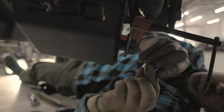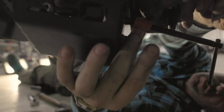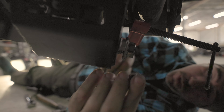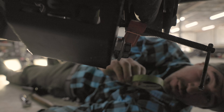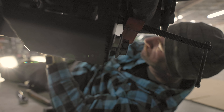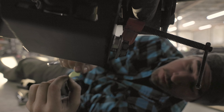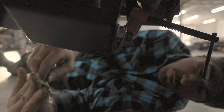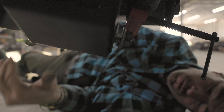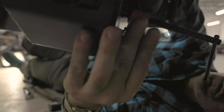Now this bolt is going to go through here like so. If you've got long enough, nimble enough fingers, you can get down inside and hold the nut in there and get it started. If you're having trouble, most of the time the nut's going to fall down in here and you'll be retrieving it. Take a piece of masking tape and tape it on the back side of your wrench. Take a small piece of masking tape, put it on the wrench, put your little nut inside there so it can't fall off. Now you can reach down in here, line that hole up, and get your bolt started.